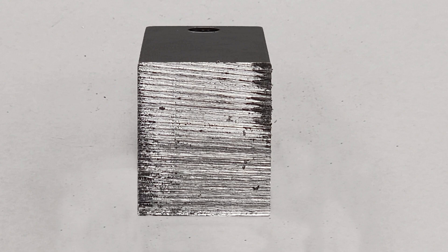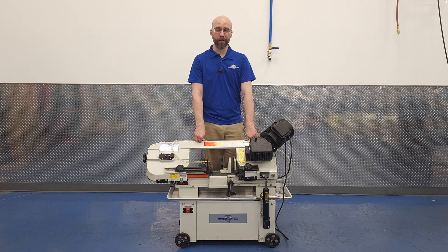Finally, I wanted to show the cut produced on that part, where we did slow feed pressure for the top half and faster for the bottom. Surface finish on saw cuts doesn't matter so much if you're going to machine the surface in a subsequent operation, but our friends in the welding and fabrication industry care, so they'll usually mess around with feed rate more than the saw operator in the machine shop. So there you have it — that should give you a good starting point to safely and efficiently cut stock on your bandsaw. As always, if you need more information or have specific questions, don't hesitate to reach out to us. And if you have anything to add or thoughts on things we might have missed, let us know in the comments. Until next time, thanks for watching.